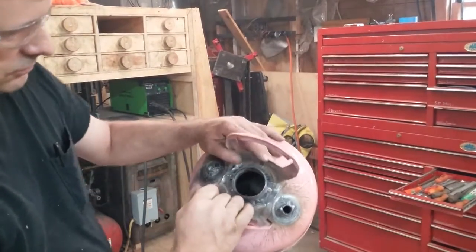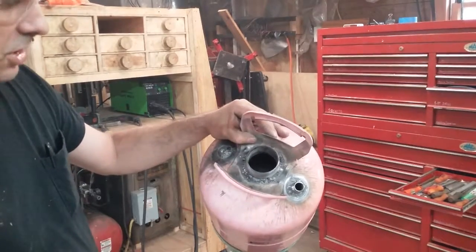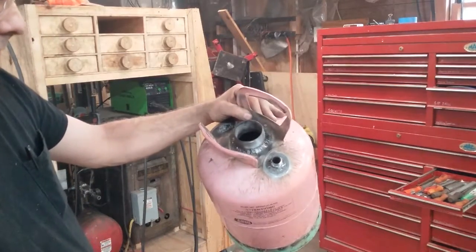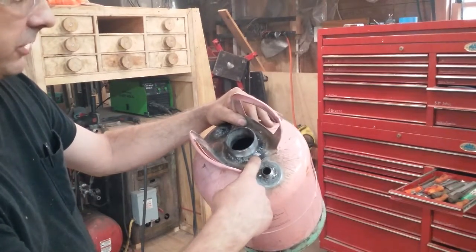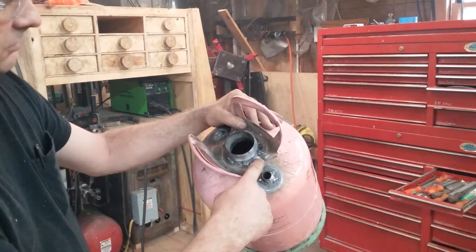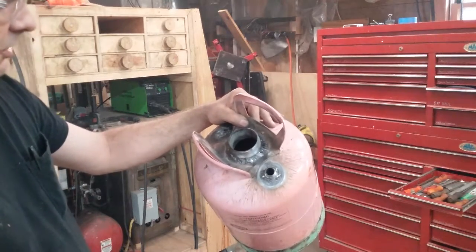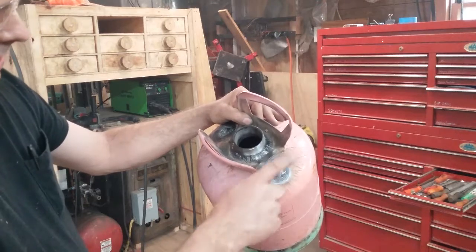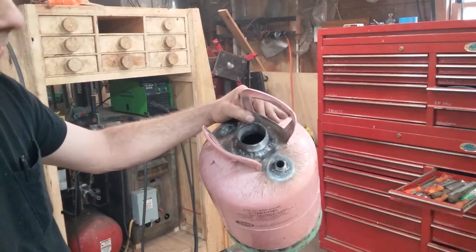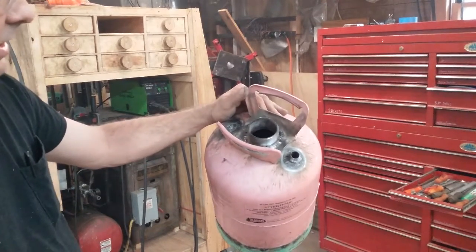There's the top of it — I wouldn't call that welded, but there's the top with some wire melted down to it. It dawned on me when I got this tacked on that there are two layers of metal here and they're not welded together except in a few spot welds, so this whole thing may not work. I'm going to get my threadlet tapped, put a cap on both ends, and pressure this thing up to see if it'll hold a little pressure without blowing bubbles everywhere.